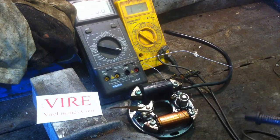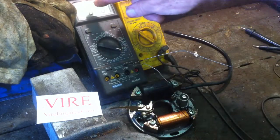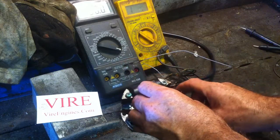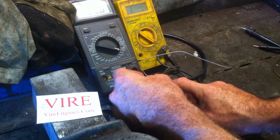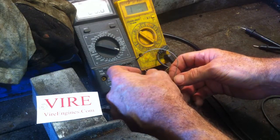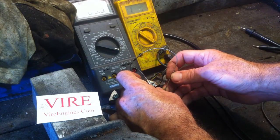Obviously there will be no charge on here, but if you do have a capacitance meter — I have one here — and you measure this out of circuit, you'll find it should be about 0.3 microfarads. One probe on the centre and one on the outside, and we get a reading on the display of 0.3.